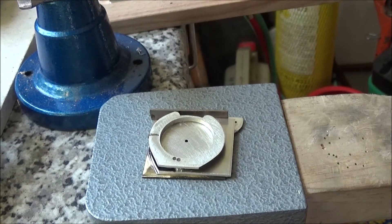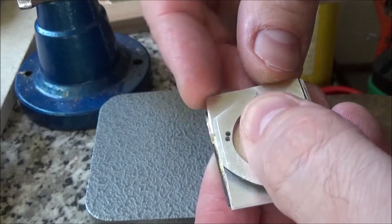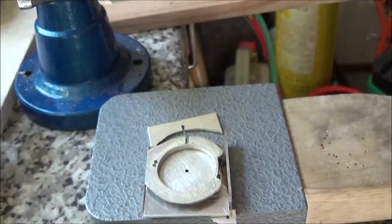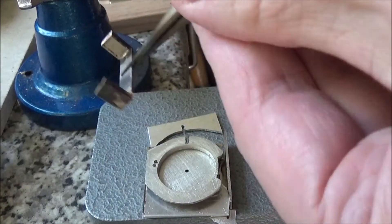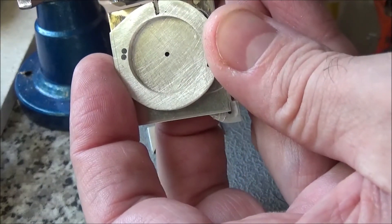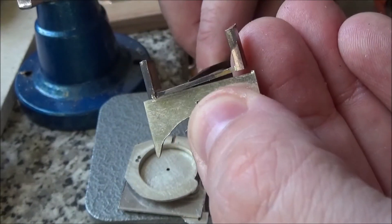Then I've still got some fun and excitement with the other end, which is going to slide in. This needs to come down somewhere like that, and this will have side balls on it which will stop it from rotating in that direction. So the lugs are solid at each end of the case. I've got various different options — I could, for instance, merely get a piece of plate and solder these onto the plate, and then offer them up to the side of the watch in such a way that they sit there, and then solder that all onto this place so that it slides into the watch, as you see like that.